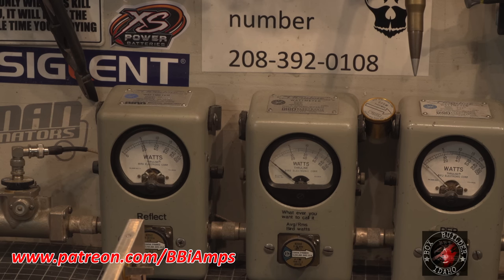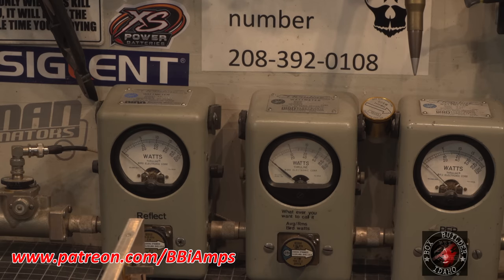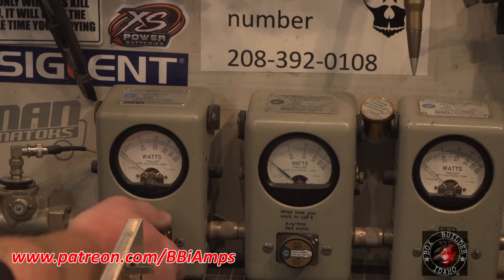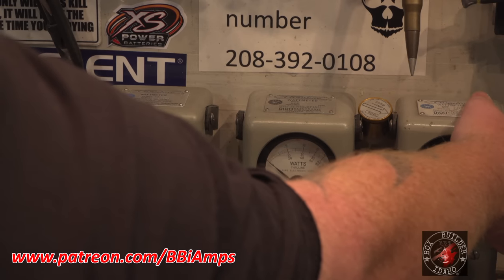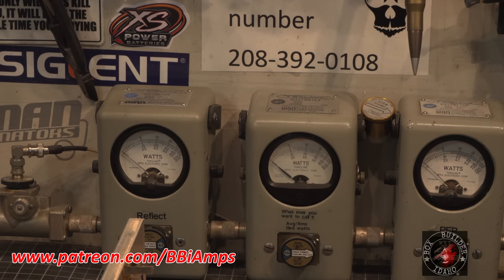Hello, audio. So I got the mic gain way down on the 2950. So we're dead keying 1 watt and we're swinging to 3. So let's turn this back around. So it's reading in reverse back from the dummy load. I'll put that on 1X. Now let me bring the 4-pill in line.